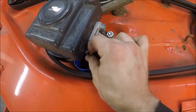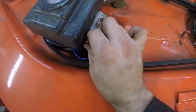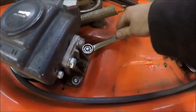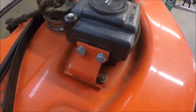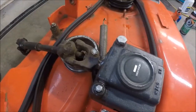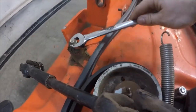I'm going to reinstall the drain plug now so I can get this oil out of the way to check the gear box mounting bolts. There are 17mm bolts up top. All the bolts on the right side are 19mm, the PTO shaft is 14mm, and the belt tensioner is 19mm.